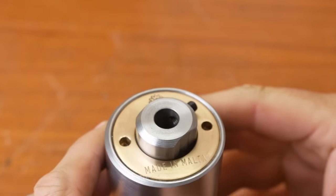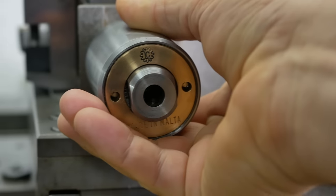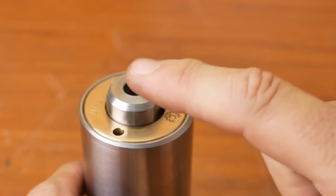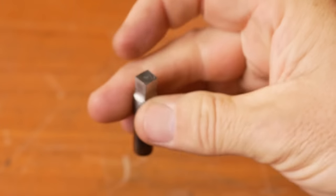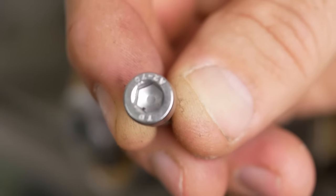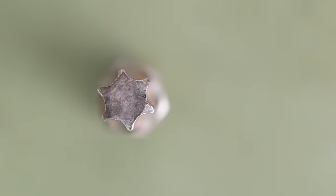So what's the special sauce with a rotary broach? Because if you were just going to drive a form tool into a piece of work it wouldn't cut. It's got a body, some bearings to mount a rotating spindle, and it's designed for drilling odd-shaped holes. The broach is made with a rotating central shaft holding the tool, set at about a one degree angle to the axis of rotation, cocking the form tool off at an angle. As this rotates, the tool gyrates, and it's that gyration of the cutting edges that does the cutting action. It's probably the most practical tool in the home shop for drilling hex holes, square holes, cam lock cams — you could even use it to make a Torx screw head hole.